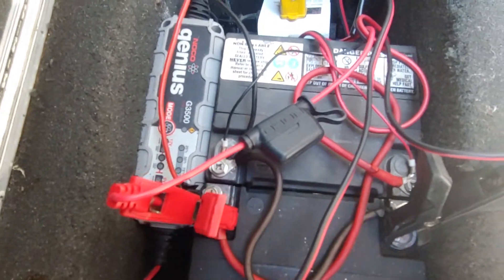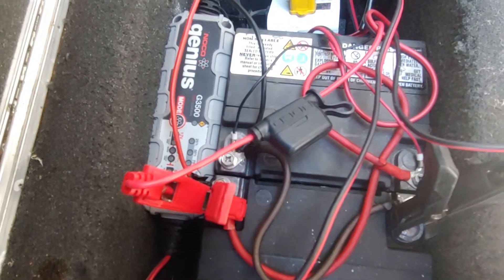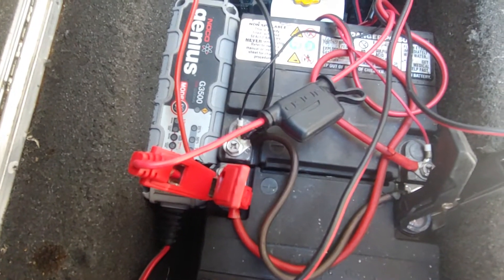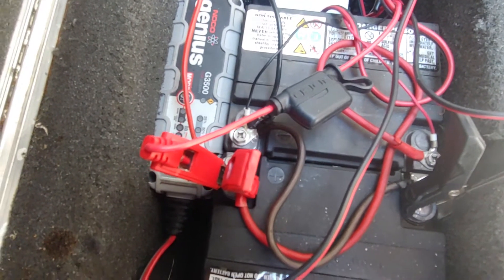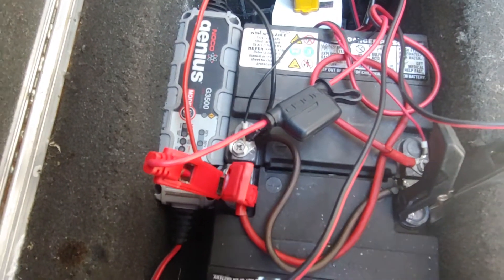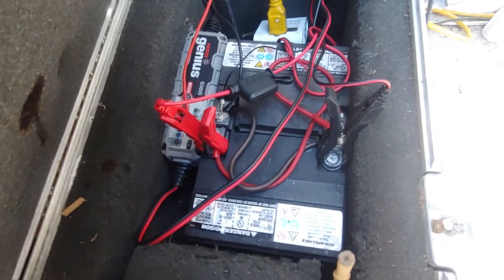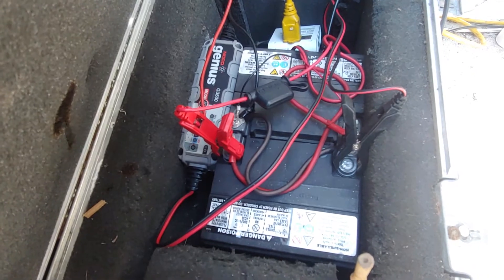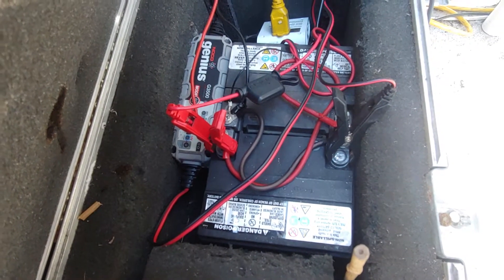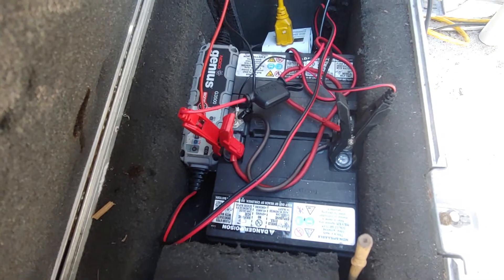The reason I did this is because last year, the pumps would die in the middle of the night. The batteries I was using did not have that many amp hours. A lot of people wouldn't have that problem with a car battery or a deep cycle battery or any other bigger battery. But since they were motorcycle batteries, about halfway through the night the pump would start to die out and it would suck the batteries all the way down to nothing. When morning came and the sun came out, it would recharge them again, so the pump would pump good in the day but it wouldn't pump at night.